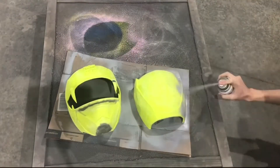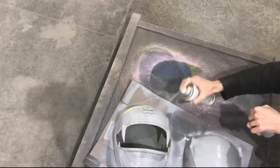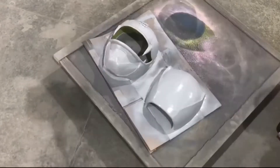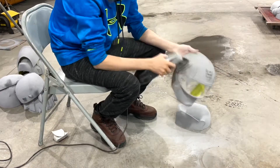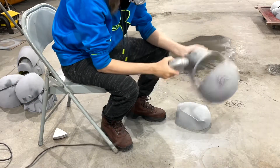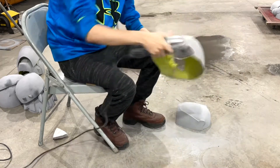And here's our first coat of primer. You don't have to get too carried away with it — I usually save the heavy coat for last. But just make sure you get every area well covered. After I let that dry for at least 24 hours, I'll come back in with some 220 and sand this all down before we move on to our next coat of primer.